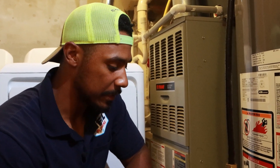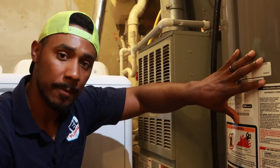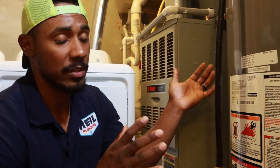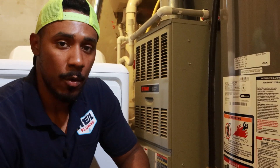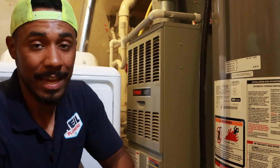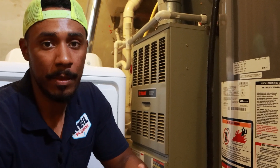Some other valves are a little different with an even smaller knob. One thing to note: this valve has A, B, and C indicators, but these letters don't correspond with any temperature listed on the water heater. Normally, water heaters will have a sticker on the side that says what adjustment temperature is what. In this case it's not listed on this water heater — so if you turn it to B, there's nothing on here that says B is 140 degrees. As a rule of thumb, 120 is usually the A setting and 140 is usually the B setting. If you feel like you need it adjusted higher, test it at the tap using a thermometer — just run some water and put the thermometer under there to confirm the temperature is whatever you set it to. For the sake of safety, if you don't see a chart, take a thermometer and test the temperature yourself to make sure you're not making the water too hot.